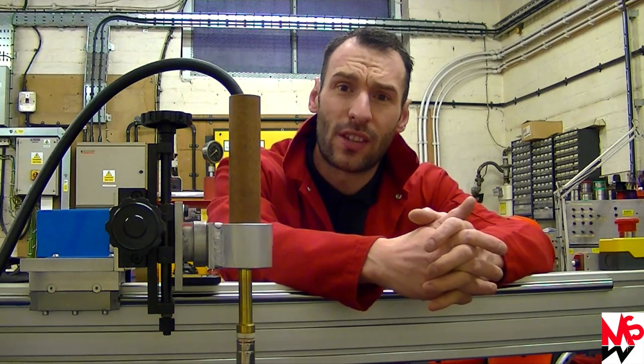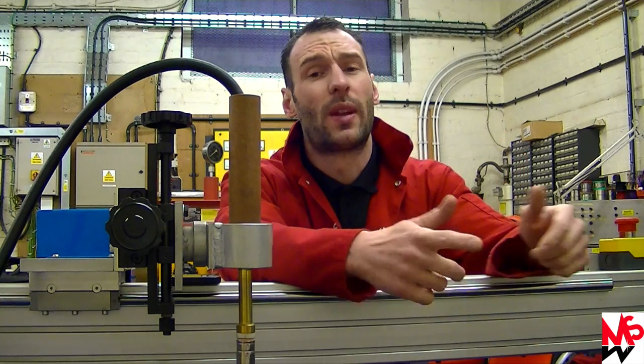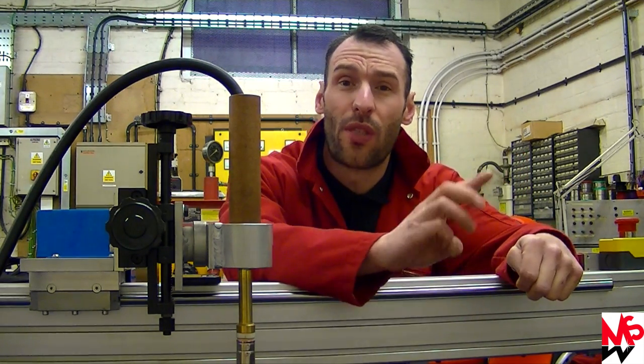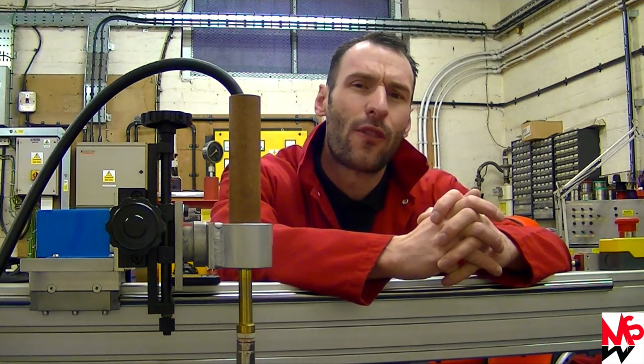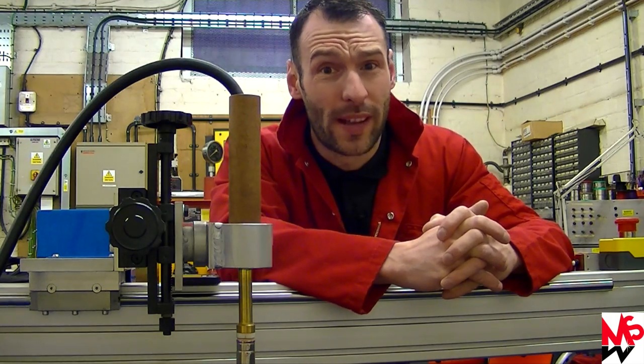We stretched the boundaries. We did this with a 25mm lug onto some 25mm plate, and one of those welds on one of those lugs was a 3-pass weld. Hypertherm say with the Powermax 105 that the cut capability of the brand new FLUSHCUT consumables is 40mm. We had about 45mm worth of cut today. Speaking outside the box, I think that's pretty fantastic.